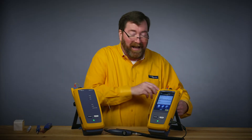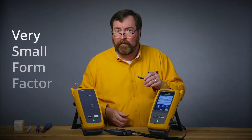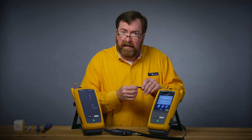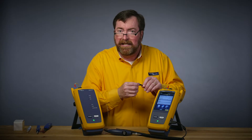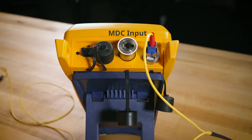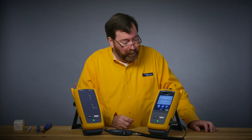We're going to take a look at how we test this new — you might have heard of it as a VSFF, or very small form factor connector. There are a couple different types. Today we're going to be taking a look at how we test an MDC connector. I have an MDC input on the port of our Versiv CertiFiber Pro, so we can set a one-jumper reference, which will give us the least uncertainty in our measurement.